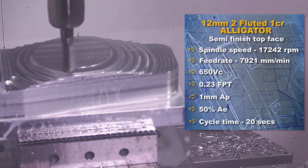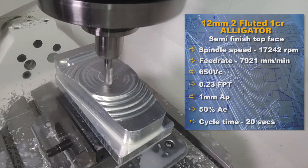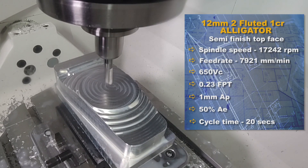If chips are thinner, quite often you can push the cutting data as well. We are running the tooling data up to just shy of 8,000 millimetres per minute. Obviously when cutting in the pocket the machine feed rates don't always reach that level, but we machine on the outside profile and try to keep the pocket machining as high as we can.